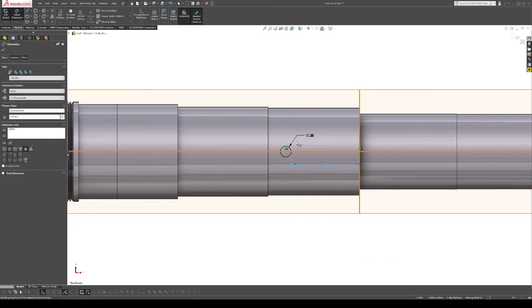The distance for positioning is 2.473 inches. This is definitely a fitted assembly type of thing — the gear is put in place and the hole is drilled through both the gear and the spindle together. If anything ever needs to be replaced, that dimension is going to be really hard to match. If you replaced the gear, you'd probably want to rotate it 90 degrees and drill a new pin hole from the side.